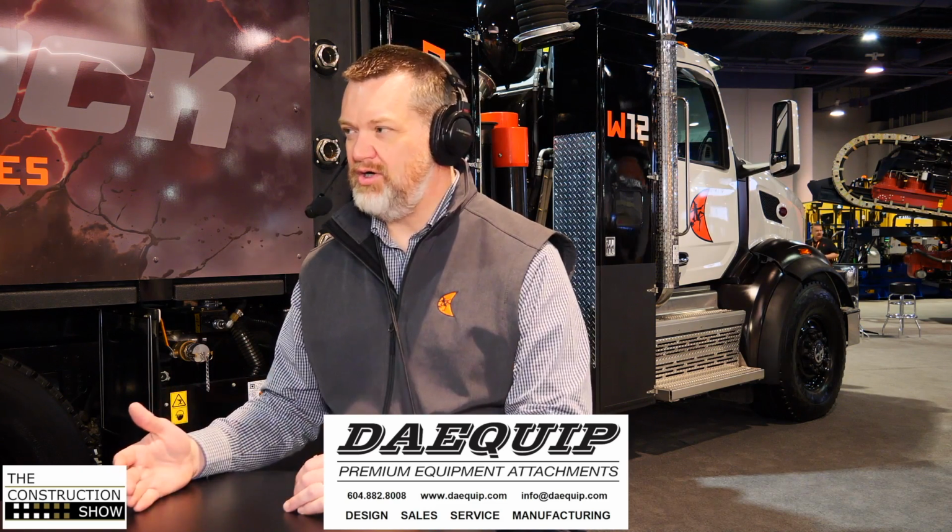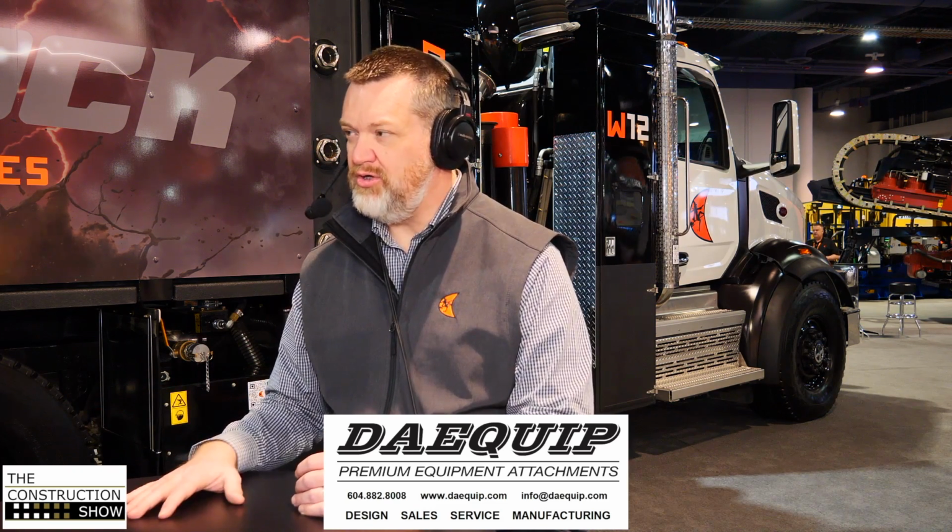On a more serious side, if you're investing in a piece of equipment like this, what are some errors people are making with machines like this, or use cases where they're endangering the machine or overextending it? I think especially if this is your first step into a large truck vac like this, in a micro trench application, you can do something called belling out the hole, and that gets in the weeds a little bit. But basically, this has such great capacity that it'll end up sucking too much material out of the bottom of the hole and making a bell shape, as opposed to what you want in a micro trench, which is a nice straight line.